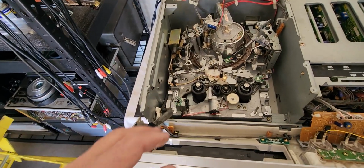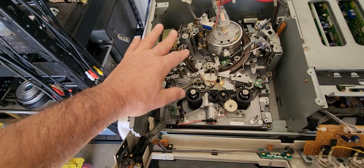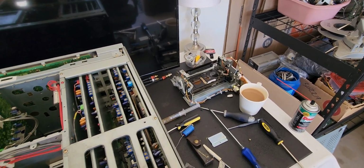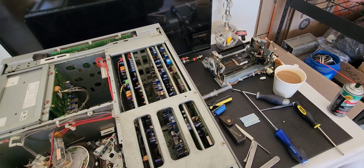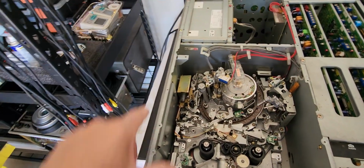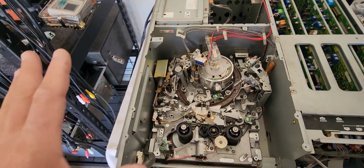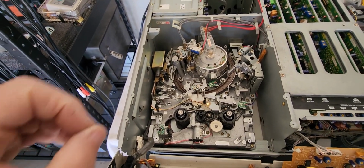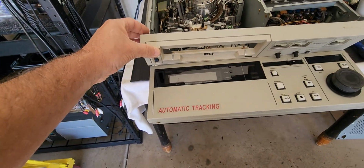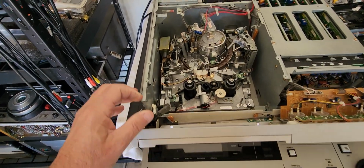You got to know how to work on these decks, guys. It's very complicated. It's a process. The tape gets loaded in the carriage. It shuffles it down to lock in place. And these gears pull it through the machine so the loading ring could drag it all the way around in loading position. If anything's off, I mean, anything in this mechanism, you're going to get tape error codes big time, up the wazoo. It happens constantly.